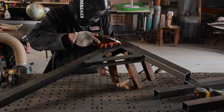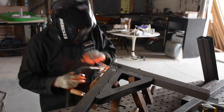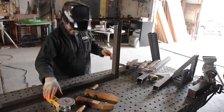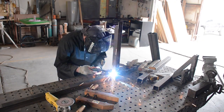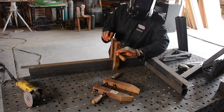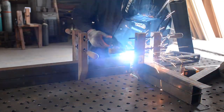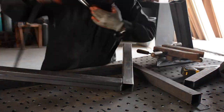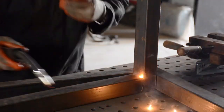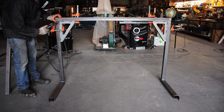You see the lap joints I'm doing there? I'm making lap joints that are going to cap the end of the intersecting tube. I'm using the MP210, and it's a little difficult to weld this — you've got to make sure you set it to the right gauge so you don't blow through. And if you do blow through, I have this technique I call the scribble weld, where I just keep scribbling over the open hole and eventually it starts to fill in. When I'm welding the thin-walled stuff, I tend to do a series of tacks connected together — controlling the molten steel is really important. If I'm having a problem, I just move to the other side of the weld. Fillet welds always tend to come out really nice.